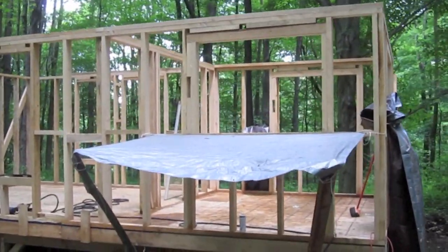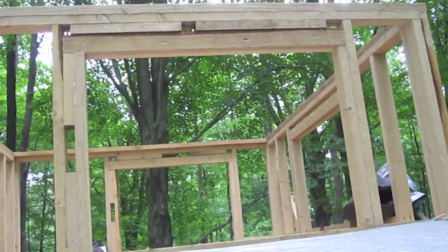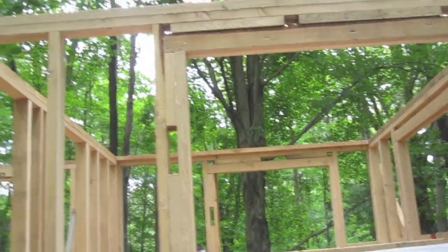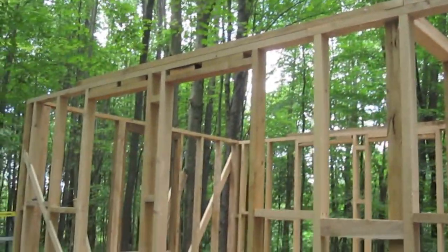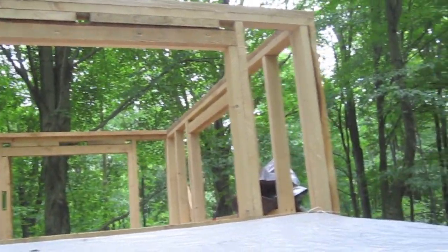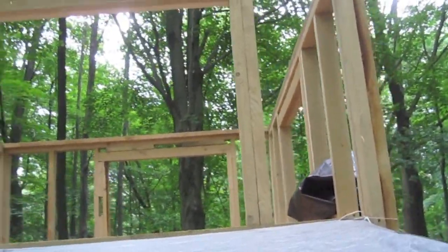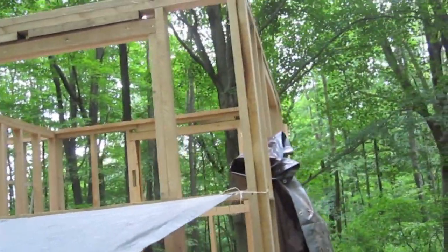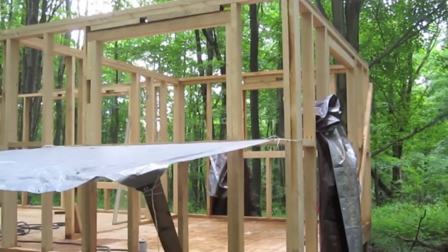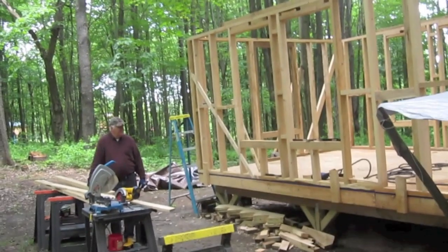We got the back room here. We're going to have a loft area above. We're using a 2x6 for the second portion of the header - the top plate - so that we can stack the 2x8s right on that for nailing. That should work out nice. We're probably not going to get to putting those up today - it'll be a miracle. Those 45-degree cuts are kind of a pain, and we forgot our chisels, so it's an even bigger pain.